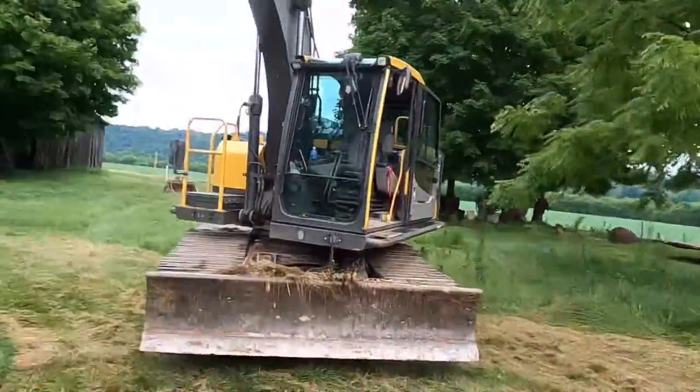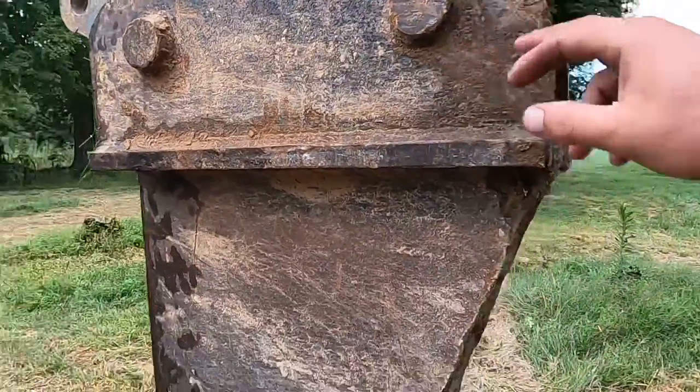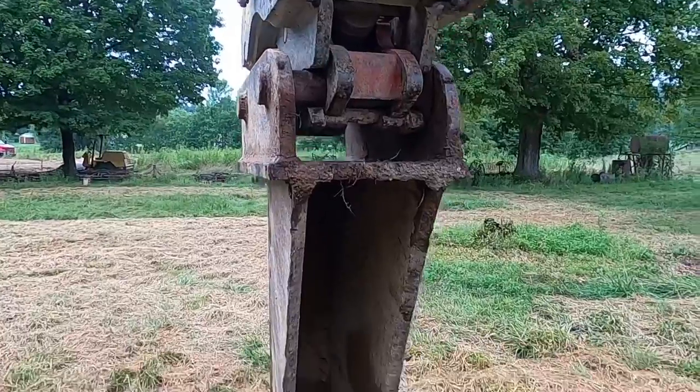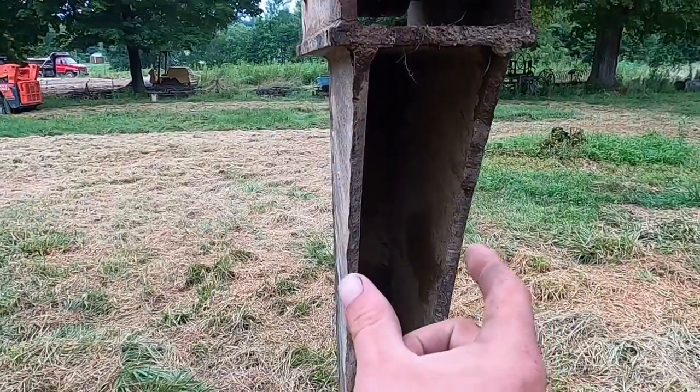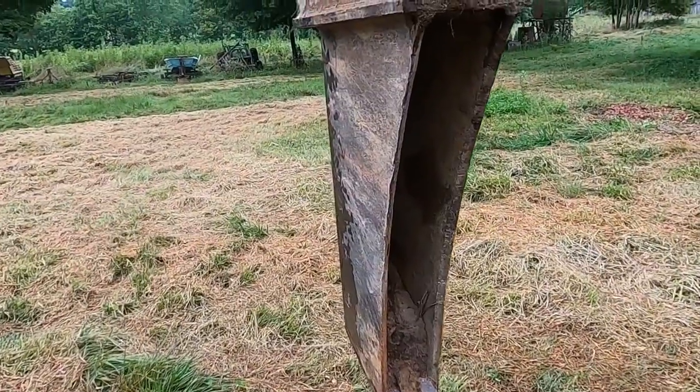But let me show you the bucket real quick. If you guys follow my channel, you've probably seen this bucket several times. I use this for trenching. I built this out of a piece of 3/4 inch plate steel. It's 10 inches wide, 5 foot tall, got 2 little fangs on the bottom of it.